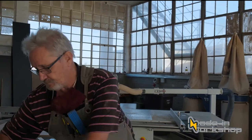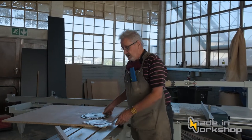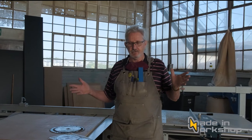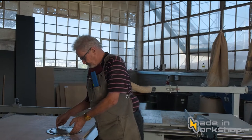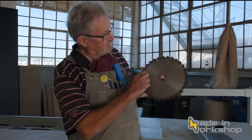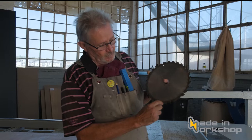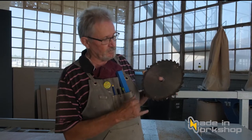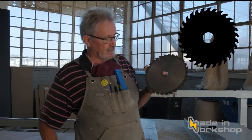I'm going to step forward and show you a few types of blades, which are very important, because a lot of people when they use a communal saw like this may just start cutting wood without checking the blade. You can see on this particular blade that the teeth are not terribly close together. This little curve here is called the gullet, and that removes the chips and sawdust. This is what we would call a general purpose, multi-purpose, or all-purpose blade.